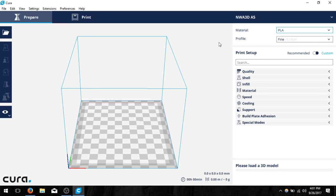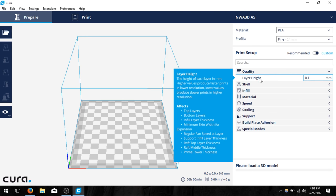It should change the material value — it may adjust printing temperature but it should be fine. Everything in Cura 2.7 runs on a profile, so what we're about to change will modify the profile and then we'll save a new one. Let's click on quality first. On layer height, if you hover over this option you should see a dialog box with information. It is basically the main determinant of quality. The A5 printers handle anywhere from 0.1 to 0.3 in layer height. I like to print at 0.2 because it's a good medium quality and it's a bit quicker than 0.1.